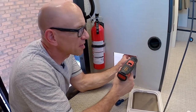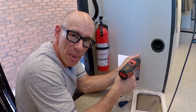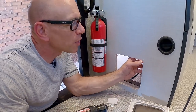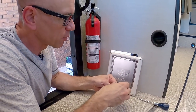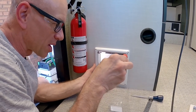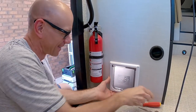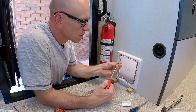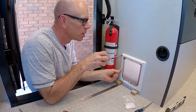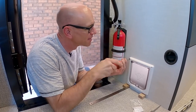Don't skimp on drilling pilot holes. You might think it's not that important, but especially when you've got something like a hard laminate, they'll keep your screw from skittering about on the surface and going somewhere you don't want it. I'm going to put one screw in, then level the door, then drill the other holes. I have lots of screw guns, but when it comes to something where I could crack plastic or strip out a hole, I like to go with a manual screwdriver. This one's actually from Switzerland — we got it when we were there RVing and it's earned its place in our RV.